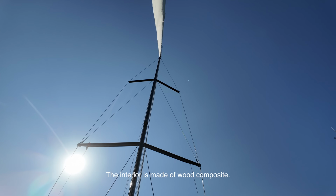So the reason we didn't use it on the rest of the hull was because we were laminating when the temp was falling, and then it's really not necessary, since the air inside the timber isn't expanding when the temp is going down. So I will apply that and put peel ply on top so we don't have to sand as much before we start laminating up here.